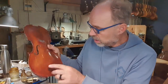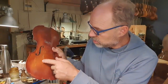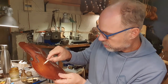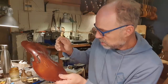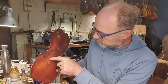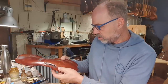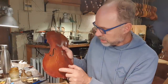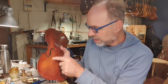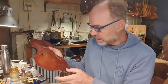The other thing I have to do is improve these cracks here, and this one here especially, just around here. I'm going to just mark this in. I'll be inserting just a very thin sliver of timber from here to there, because that crack just wasn't correctly glued at all. This crack hasn't been repaired very well, and neither has this one. So part of my repair is actually getting this crack looking good, getting this looking better, and getting this looking better at the same time.